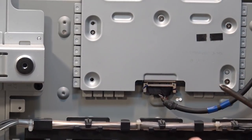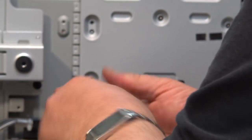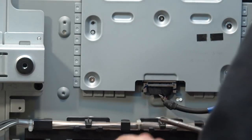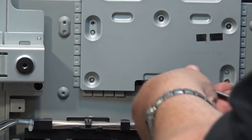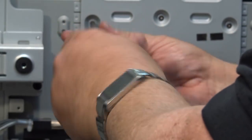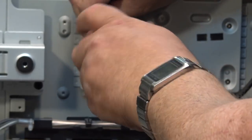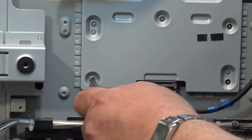I got this TV given to me, so I'm really interested to see whether my diagnostic skills actually paid off, but I'm pretty sure that was the problem with this thing. Just the way that chip was getting hot, and when I hit it with cold spray, everything changed.